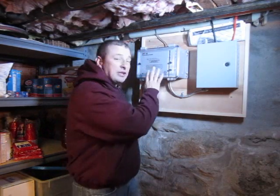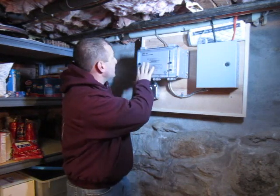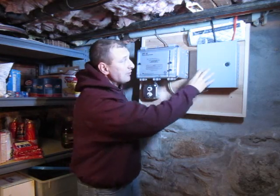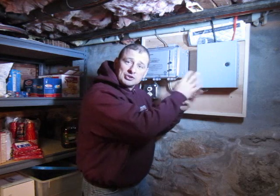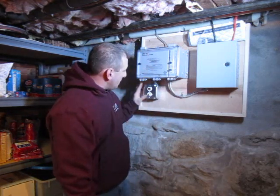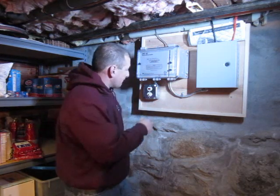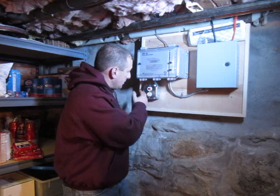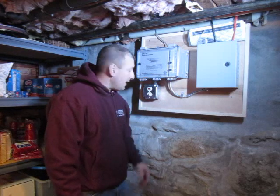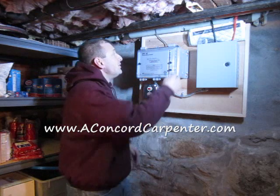We're down in the basement. This is the Warmly Yours control panel, called the APS-3C — it's a snow melting ice controller and pretty much the brains of the whole system. This is a relay box where all the power comes in and goes out to the different relays that control the heating cables. I had the electrician install a basic override switch — nothing goes to this system until that switch is turned on. It's useful in an emergency to turn the power off or service anything, and also if I just want to control the system manually.